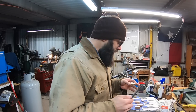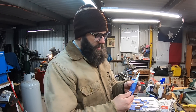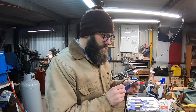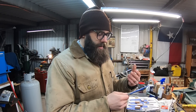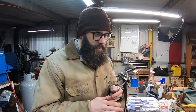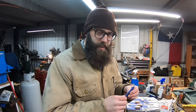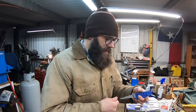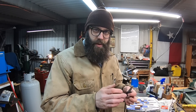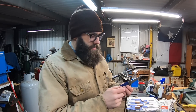This is something I figured out the hard way. When making a smaller knife — these little guys are going to be great little field dressing, skinning knives — the blade isn't super thick, about an eighth of an inch. However, the tang is thicker, just for the reason I mentioned. It might be a little counterintuitive to make a nice thin knife but then make the tang or handle assembly thicker than the rest of the knife. But since making a wider slot is so much easier, this tang is thicker than the actual blade. There's also the advantage of a stronger tang, which is great.